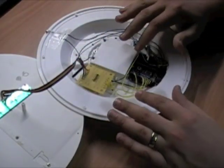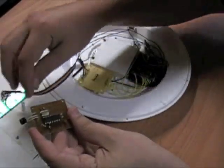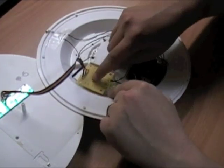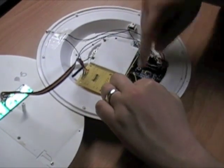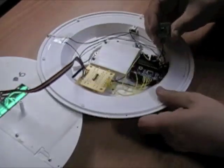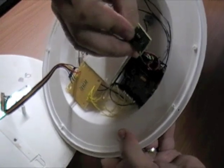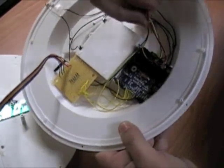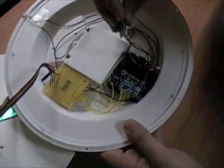What I did is I simply removed the resistors that would limit the current to the LEDs. I took the ones right out of the original project and put them on my own little perf board here and attached them each to a pin on the Arduino. I also used this little real time clock module here, available from SparkFun Electronics.